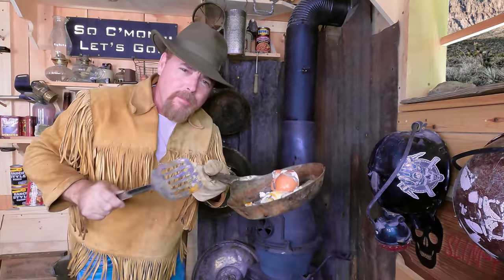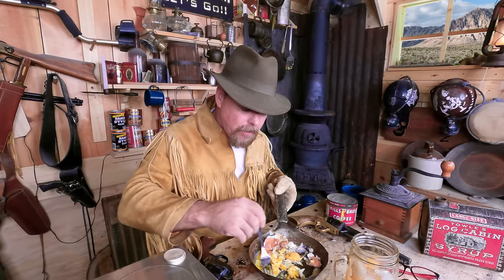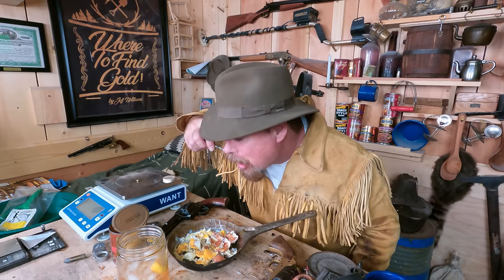Ooh, those are pretty good. You want some? Now, lead isn't normally used for this process. Usually, it's silver or copper. Now, litharge is used all the time whenever you're smelting down your ores that have a low content of gold in them. It acts as a great collector metal. The only difference is after you get a button of lead out of it, you'd pound it square, put that in a cupel, and then cupel that in your furnace. And that's what they do today. In fact, you'll see that process a lot whenever you're doing fire assaying.